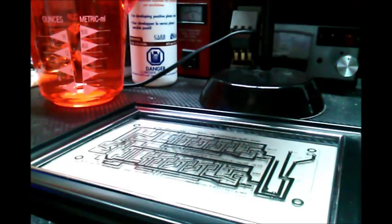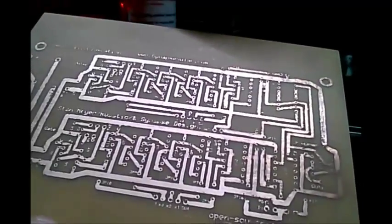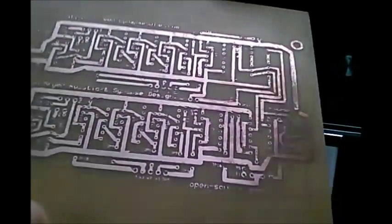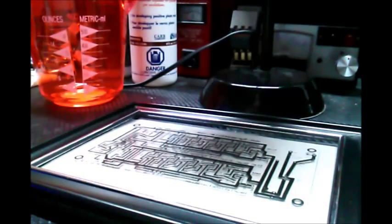I've made a couple of attempts at a printed circuit board toner transfer and I wasn't very happy with the results. We can see there are a lot of imperfections on this board. I was using glossy paper on a laser jet printer and then the hot iron method, and that wasn't very successful.